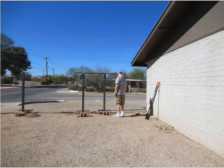So standard, putting posts in. I'm using clamps here. Just 2 chunks of 2x4s with bolts. Tighten them together so you can get them lined up. If you can see, I've got levels on the posts there. This is going to be where a gate's at, so I'm being extra fussy about making sure that the posts are the exact same height and are exactly parallel. You definitely want your gates to be looking sharp.